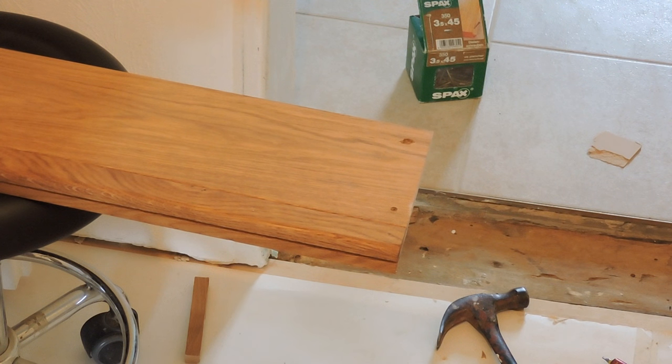Too large diameter. The pressure was too great when the head went into the opening. So what I'm going to try to do is glue it. I'm going to put a larger screw in there and open the hole up even further. Put some wood glue in there.